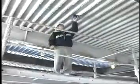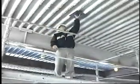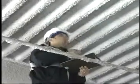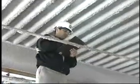On flat decks, measure 4 points symmetrically within a 12-inch square area. For fluted deck, mark the area and take 4 random symmetrical measurements on each of the following: valley, crest, and sides, for a total of 12 measurements.